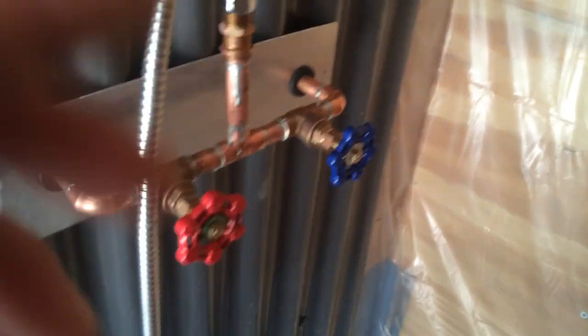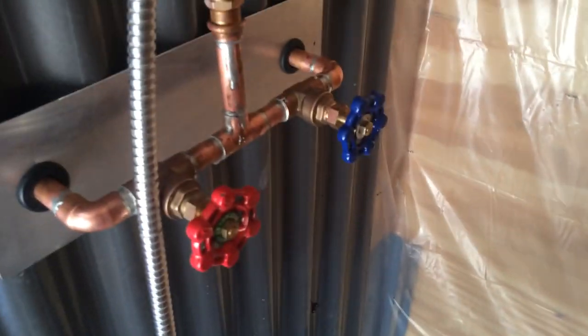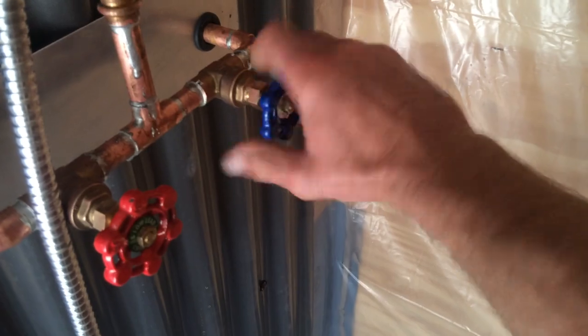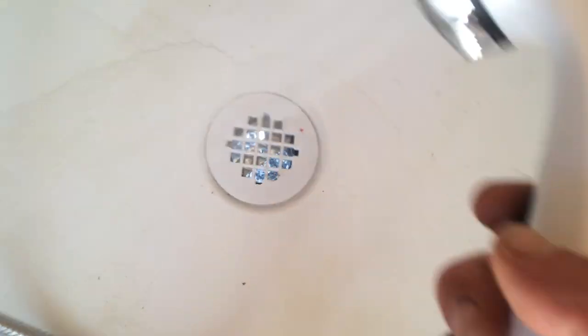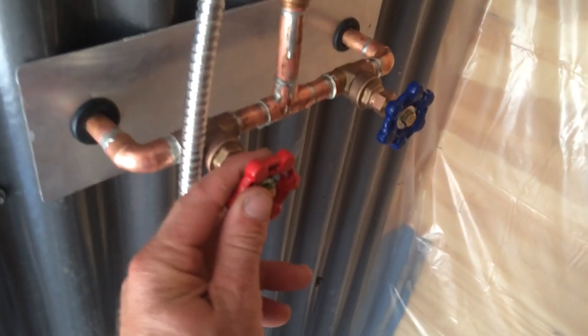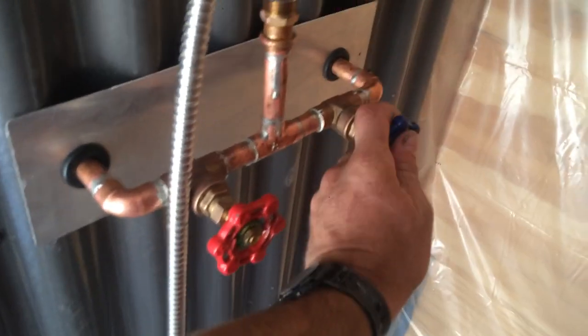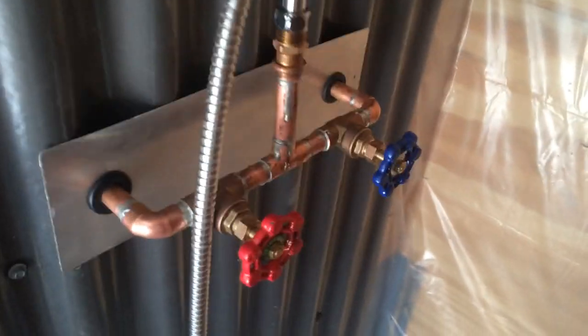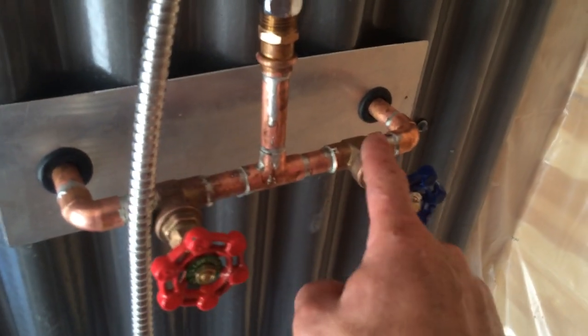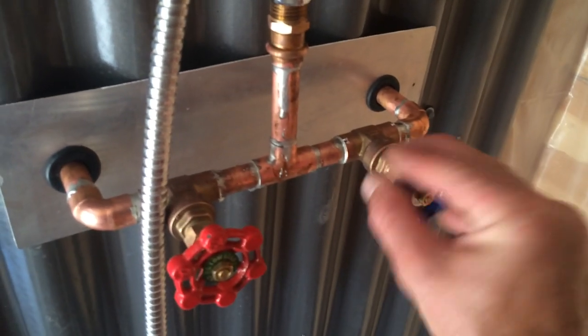I just went with blue and red — hot and cold. I don't have my on-demand gas set up yet, but I can literally turn this and open it up — isn't that cool? I made my own mixing valve. That's basically how a mixing valve works: you got cold coming in, hot coming in, and you can alter which is which, and then it just goes up through the center.